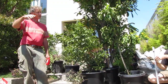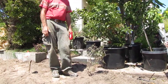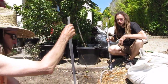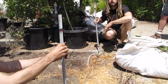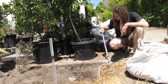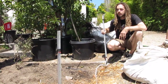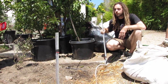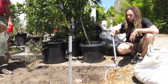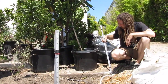That tape line was basically where we wanted to go, and then we cut it with rototillers, shovels, and picks. But in other ones we've done, we took a road grader and just laid it out with the bubble line. We also have a bubble line that you can get on a stake like this. We'll take the difference and find how far you want to drop in elevation on the stake. I think 1 foot. Let's try 1 foot, and then stake it out all the way along. This sometimes restricts you if you're going to do a whole mountain, cutting a road or something like that.